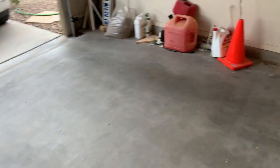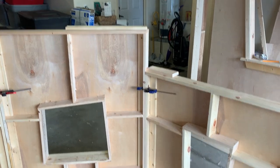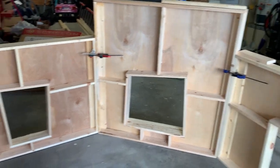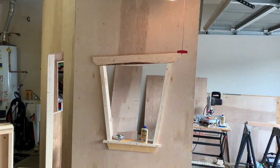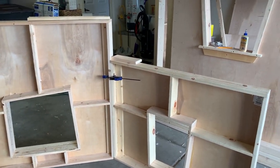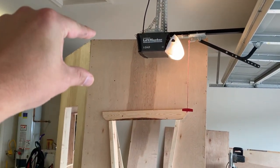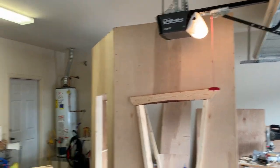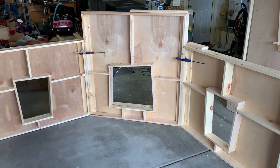Let's go back and look at how I framed it. So if you saw my first video on framing the flats, I kind of did the same methodology — I framed the perimeter out and then I laid out how I wanted the windows to look. Now if you notice, these windows are much smaller in scale compared to these ones, but they're similar shape and size. That way, once it gets up and we put the balcony on right about here, so this portion will be the second story as well, and then the additional three to four feet on top of that to kind of force the perspective a little bit to make it look taller and further away by making the features smaller.